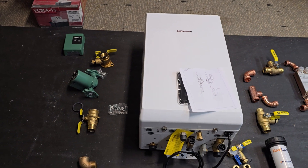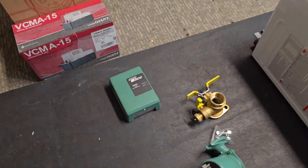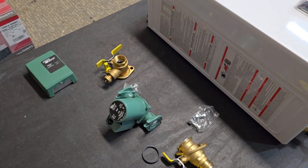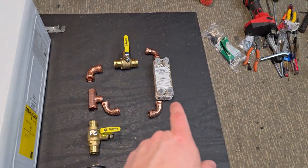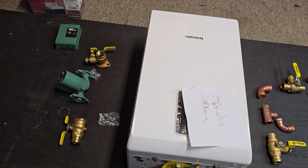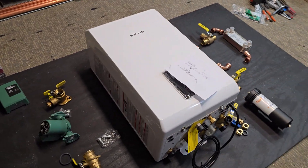This home has a bunch of radiators on the single zone. Even though the boiler can control up to three zones, I went ahead and purchased a single zone switching relay because I plan to set this up so that in the future you could add an aquastat to monitor the temperature of the supply coming from the wood boiler and actually trigger the boiler to turn on, or just turn on the pump. It's a little complicated if you haven't done that before, so I'll probably explain that after the build is completed and how we ended up doing the wiring.